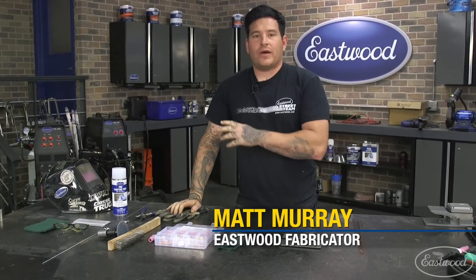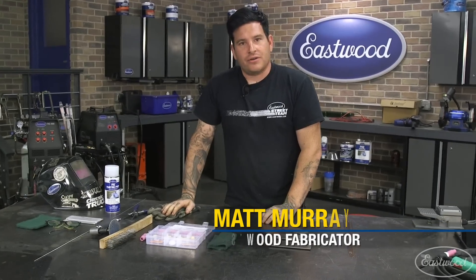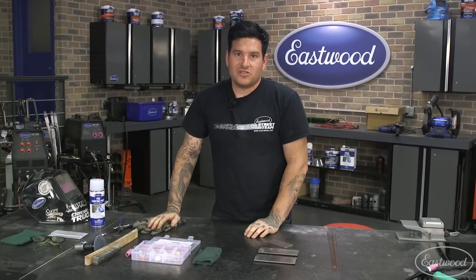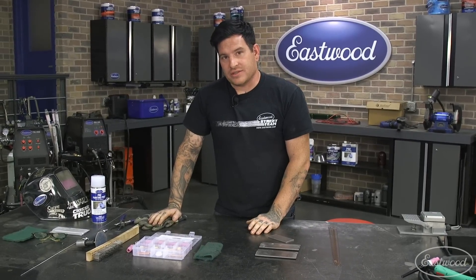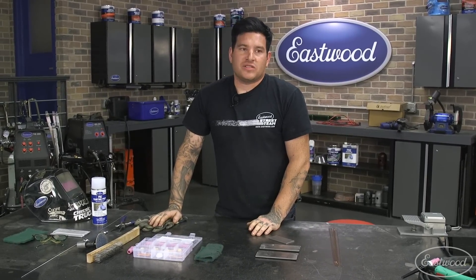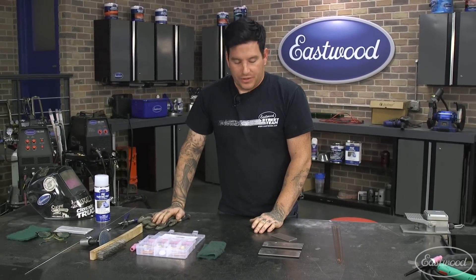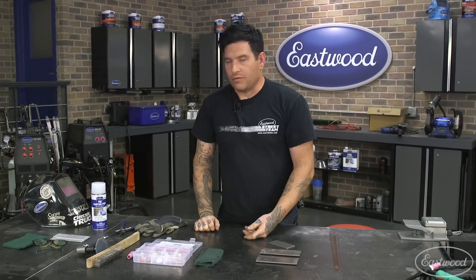So cleaning the metal — how do I clean the metal? With TIG welding, the way I describe to everybody, because they always say, hey I heard with TIG welding it's got to be pretty clean — and the answer is yes. What I say is ideally it needs to be surgically clean. The cleaner your metal is, the cleaner your weld is going to be. It's a pain to clean your metal and spend all that time, but it's really going to help your weld in the end and give you better results overall.